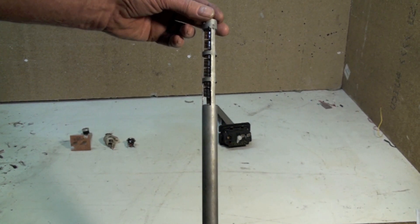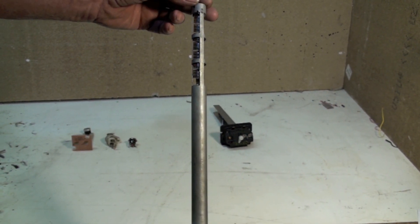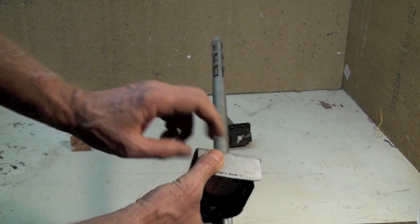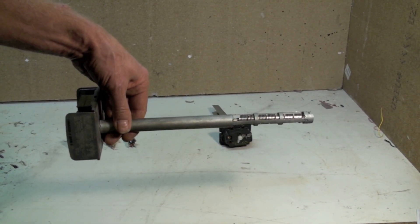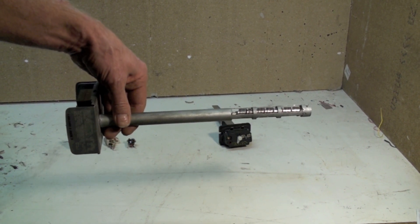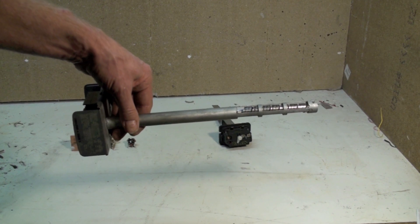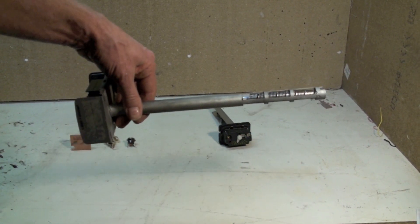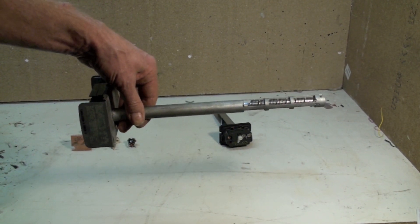That's the old FNL. They come with this probe here — 11 and a half inches long. They also come with an eight incher and a five incher. Do not mix them up. If it comes with 11 and a half, put 11 and a half in it; if it comes with an eight, put an eight; and five with five. If they're set in the wrong distance, you very often will get erratic fan operation.